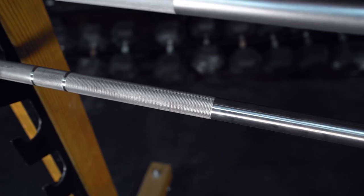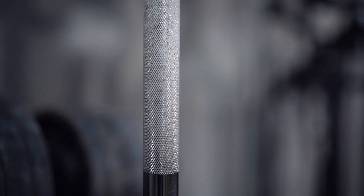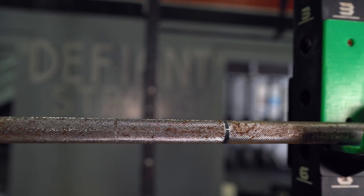Let's start with the finishes that won't affect your grip of the bar, such as a bare steel bar or a stainless steel bar. These bars do not have a finish and are essentially raw steel. Once you cut the knurling onto the bar, you're not going to apply a finish on top of the knurling, so your knurling is going to be more pristine and more aggressive. On stainless steel, you're also going to have a pristine knurling, but because you're using a higher quality material, you're not going to get as much corrosion on that bar.